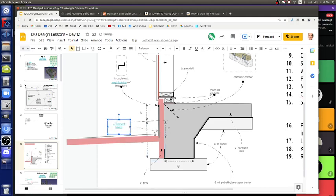Let's do that right there. That's the stuff protecting the insulation from getting chewed up by critters and by people kicking it or going into it with a lawnmower or whatever. You're protecting the soft insulation with cement board. We've got those boards sitting in the material areas. They're already cut to 12 inches tall.